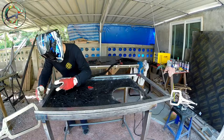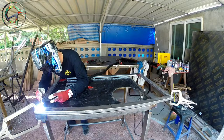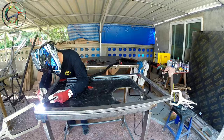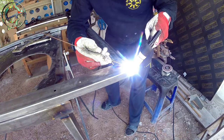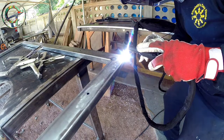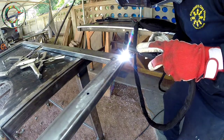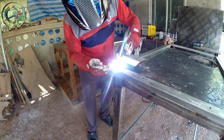Consider that I do weld outside my laboratory. I'm welding with mild steel rods ER-70S6 with a diameter of 2 to 3mm. My welding current is between 40 to 60 ampere. My welding is producing sparks and that is not correct at all. Maybe the steel is not clean enough, or maybe the argon flow is too high — let's find out.